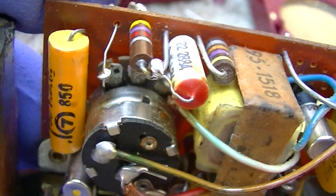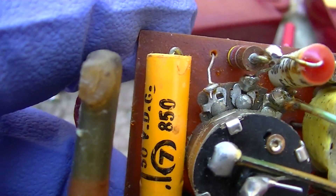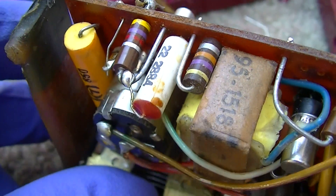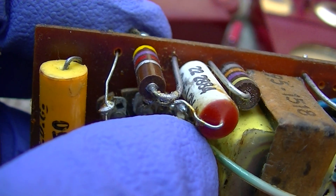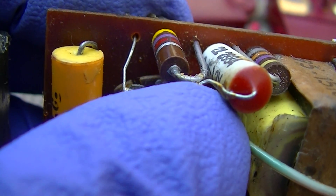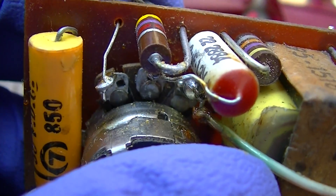What's going on here? This capacitor is bypassed - see how it's soldered to that resistor? It's bypassed. How is that possible? So I take the horrible solder blob off and it stops working. Because the capacitor is bad, they bypassed it. That's real good... that's real good.